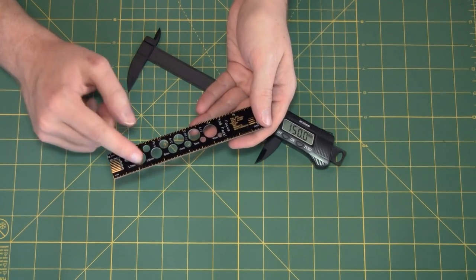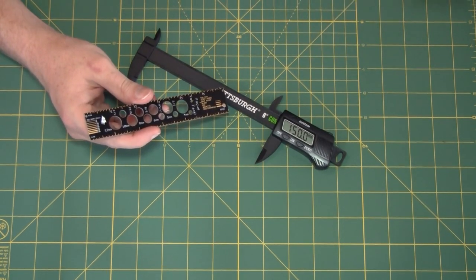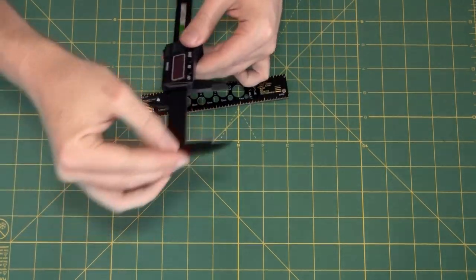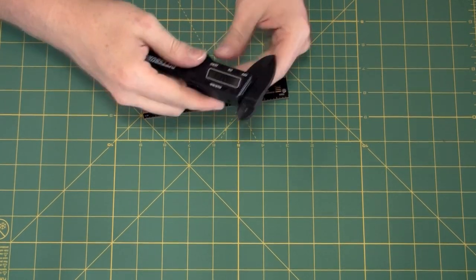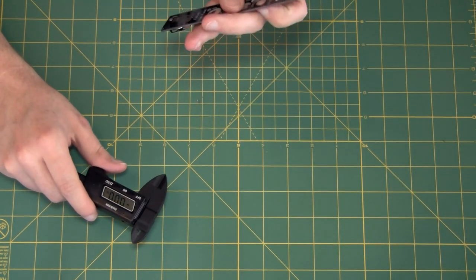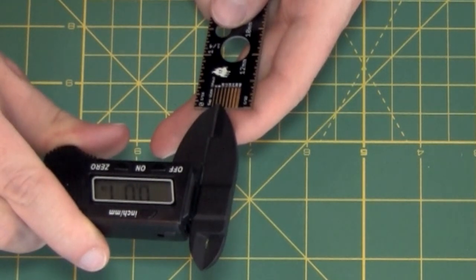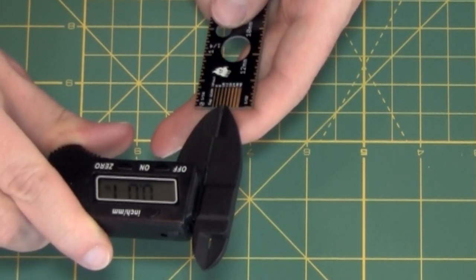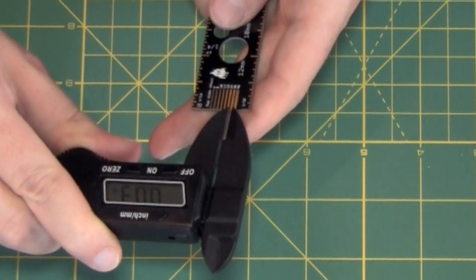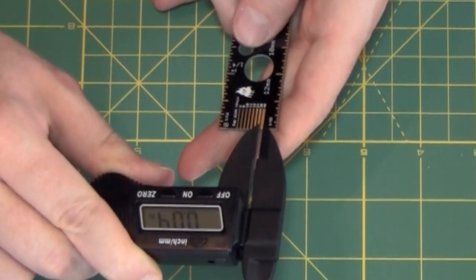So we've got both scales there, and of course you've got your bolt hole scales, which you can cross-reference with the tables that he was so kind to send along. And we have our gap widths in thousandths. Let's see what we got here. Thousandths of an inch. I can only go down to hundredths on this, so I guess that's kind of moot. But I can do multiples of 10. So 10 thousandths would be 0.01 inch. Looks pretty accurate. And then let's do 30. 0.03 inch. That looks pretty accurate. And then 40, 0.04 inch. That's pretty accurate there.